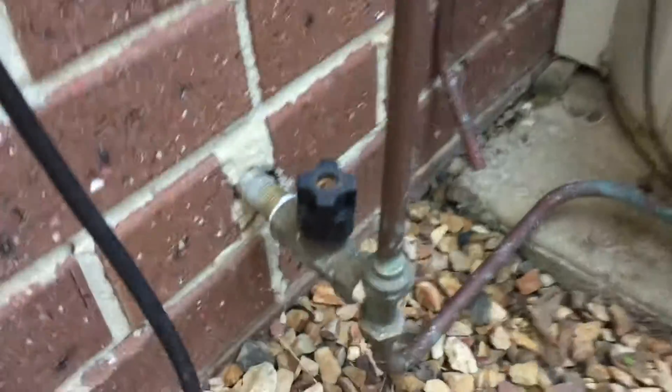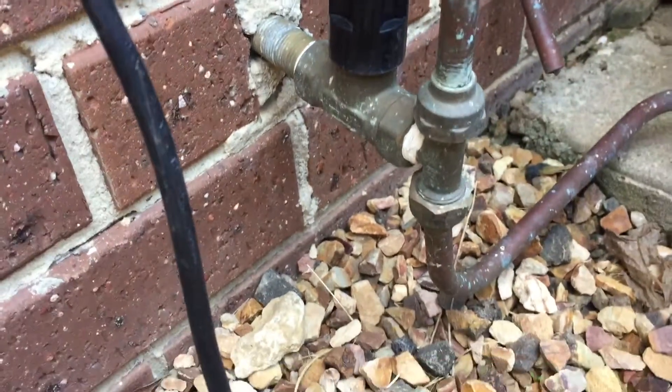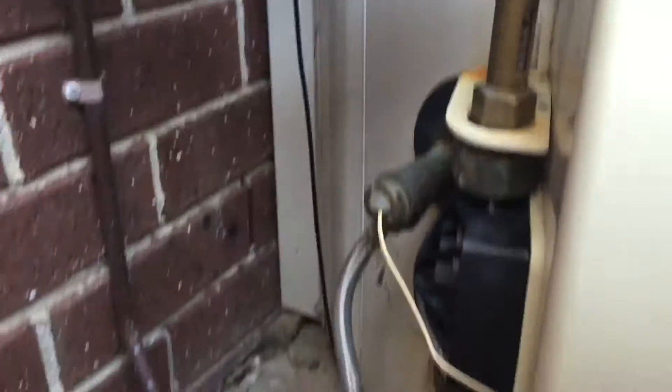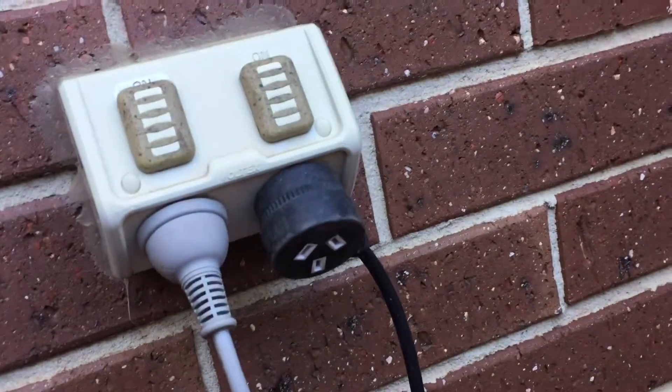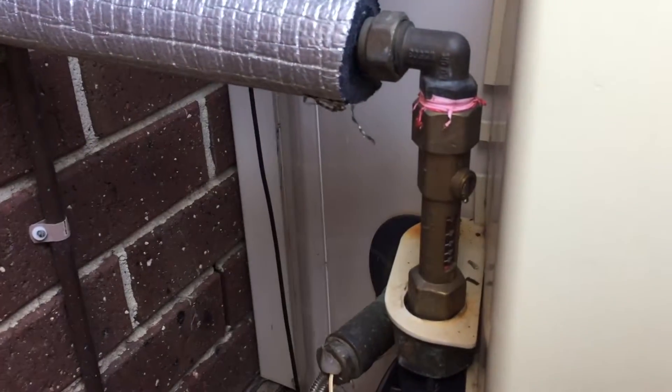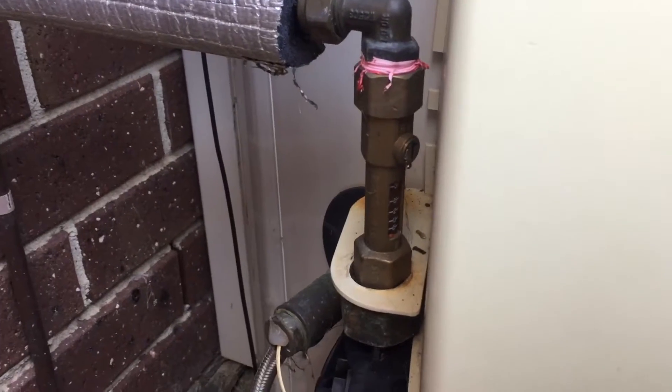Obviously I've got to be able to turn the water off. That's easy here because this is where the water comes in from the source, running to the hot water service up through the bypass valve and down into the hot water service. So I can turn the pressure off from the water there. This is the solar pump system, so I can actually just follow that power line along and turn off the solar as well — powering the whole thing down, turning off the solar pump and turning off the water pressure.